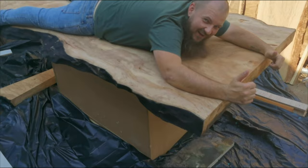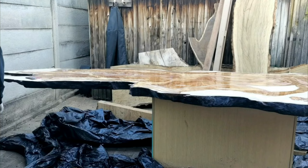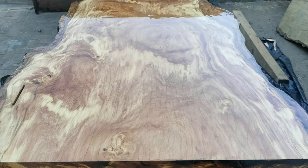Next up, we sealed the slab using our Prima epoxy. Prima epoxy is great for waterproofing and sealing surfaces. This is also how you avoid a lot of bubbles in your resin later on. Prima epoxy works better than other sealing agents when working with epoxy because it is an epoxy itself — it isn't foreign to the resin you are using. Remember that any solvents, oils or water will cause your resin not to perform properly.